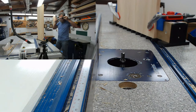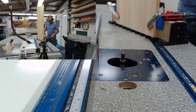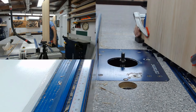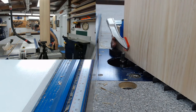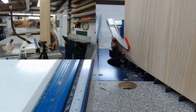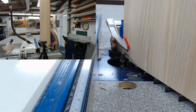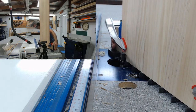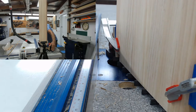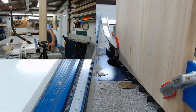I'm going to put these on. Stay safe - it will make some noise; the router always is noisy, you may want to turn it down a little bit. The dust extractor will turn itself on. This is a very tall board - nearly four feet tall. I'm going to come across the front first because that's a climb cut and that gives me the cleaner cut. I'm going to go in halfway, come back, across, and then all the way in, across the back.